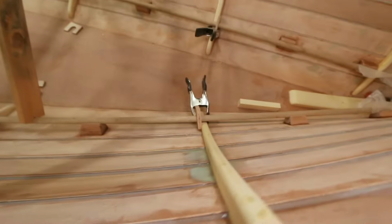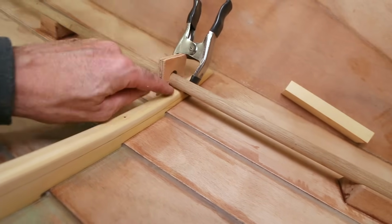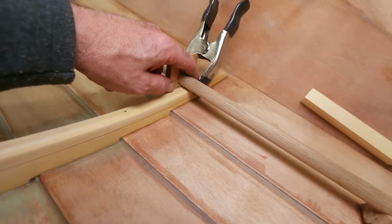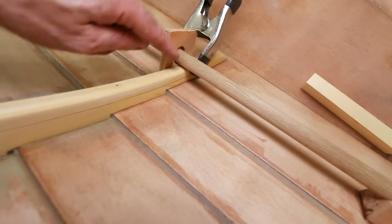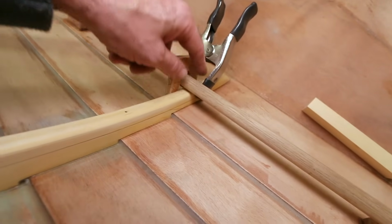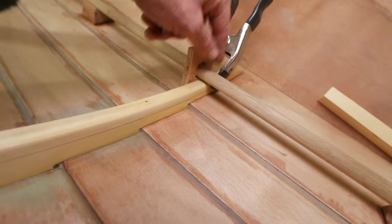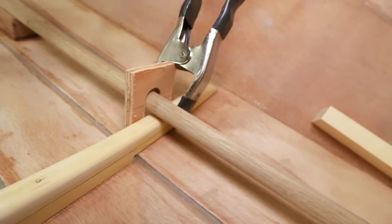So what I think I want to do now is take the dowel here. I think I'm going to wrap a bit of packing tape around it in the locations where it's going to be fixed. And I'm going to do a second glue up where I'm taking some thickened epoxy and I'm just going to fill this joint here either side and create basically a little tiny version of one of these, but it's just going to be solid epoxy. And we'll just put all of this back in. I think I'll set this up to do the screws right away, and then once it's all done, I can just unscrew these and it'll all align. We'll just do a little cleanup of all the squeeze out, clean up all the rough stuff.